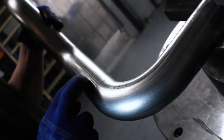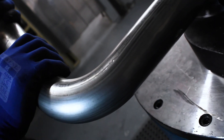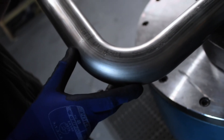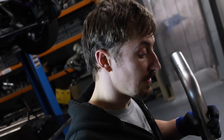The tube has now been released from the clamp. We've done three bends with two rotations and we've got this full section with no weld joins in it. This is the real advantage of mandrel bending and using mandrel bent sections — if you're making the same thing repeatedly, cutting and welding it together, this is a far better way of doing very accurate, very repeatable work with almost no labor. There's no cutting or welding involved; this is all just mandrel bent. So if you have a section of tube that you make from off-the-shelf mandrel bends and you're looking for a faster or more cost-effective way of doing it, this is definitely the way to go.